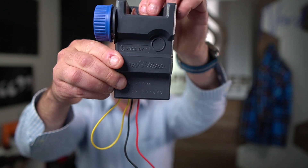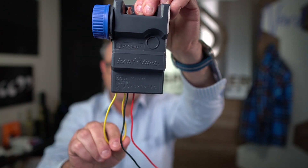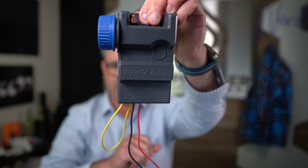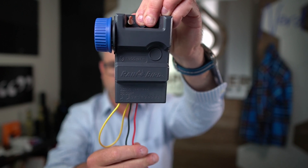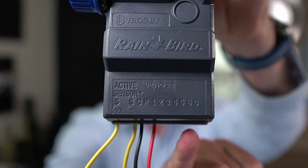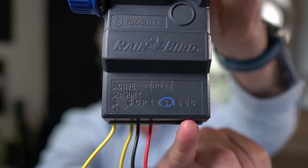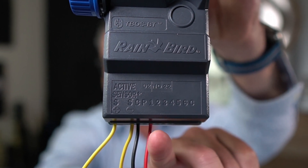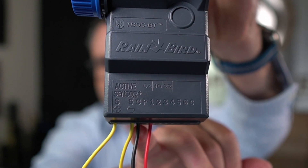Now that we've got it up here, let's take a look. This is the rain sensor terminal — if you want to hook up a rain sensor, you just cut that. Then you've got your two wires for your valve, and if you have more valves, you can see it's labeled all the way up to number six. There's another common wire, and at the two-, four-, or six-station models you also have a pump start or master valve terminal. On the single zone system, there's no master valve, so keep that in mind.